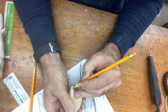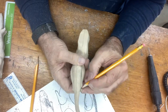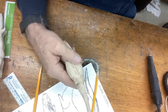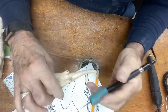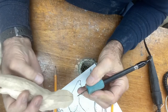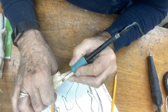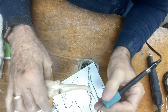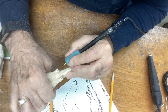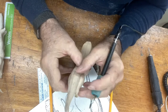And these are the ovals I was talking about earlier. I sort of jumped the gun on that. So on that, you can mark out. Well, that burning didn't come all the way through. Let me go back one more time on the back one. I don't see them projecting through. So what I'm going to do is burn through there so that you could see the toes on the other side, at least the burnt area. And if you were using a bit to do this, you would undercut through there as well on the bottom side and project the pencil line around so that you can show a little bit of the toes as they come around. See how they come around just a little bit right there and right there.